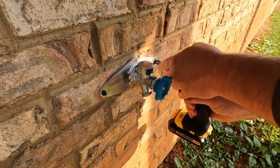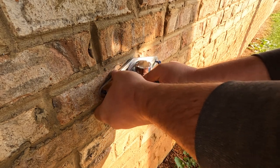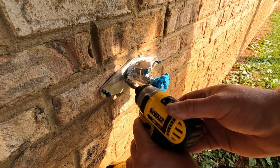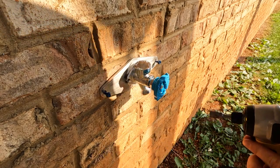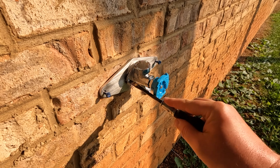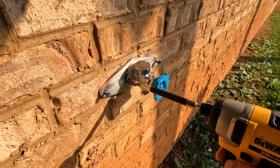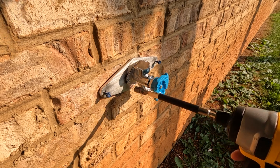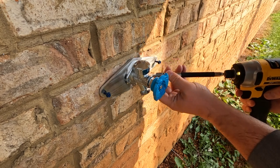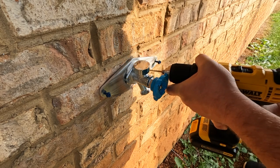For some reason I'm getting caught up on something and the hose bib won't go all the way in, so I'm going to have to back out the TAPCONs to give me a little play to work with. Another obstacle I ran into is that once the Bib Buddy was anchored in, my mounting holes aren't lining up. I'm also realizing the hole on the outside of the house and the hole on the inside do not line up perfectly, which is causing me to not be able to get the hose bib flush against the mounting plate. At this point the mounting hole was so far off I had to re-drill a new hole.